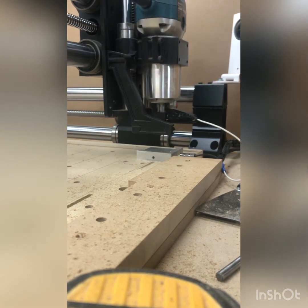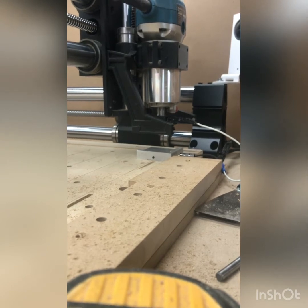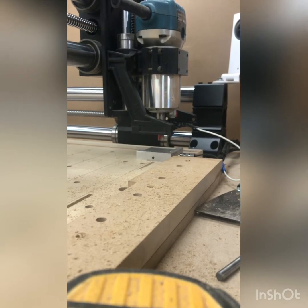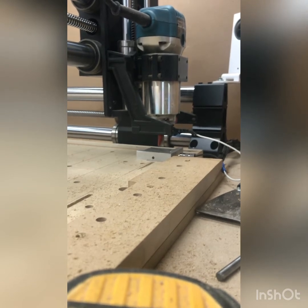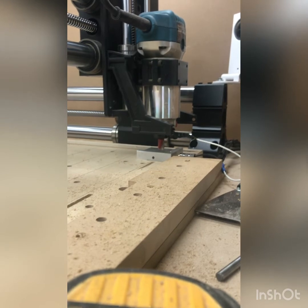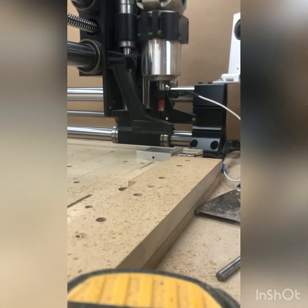It's going to seek down and find the probe. It's a little bit slow — it's best not to use a feed rate above 100, as I've seen noted in a few different places and people's posts. When you're going from a long bit to a short bit it takes a little bit longer. It's touched off and headed back up close to the absolute top. Dialog box: Remove magnet, replace dust boot, click continue.